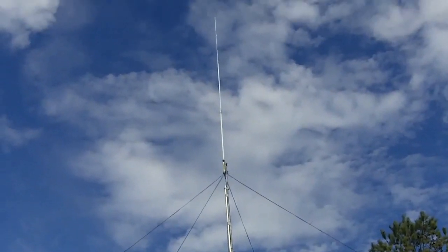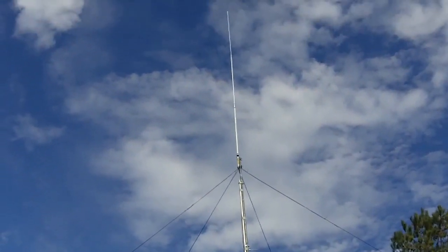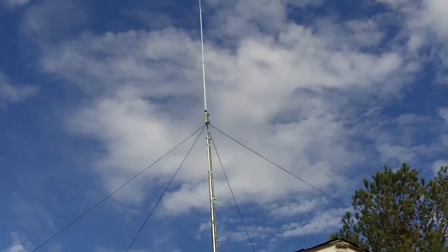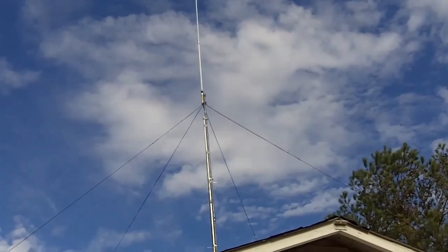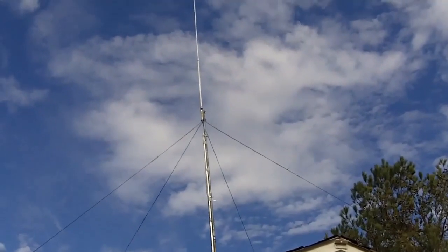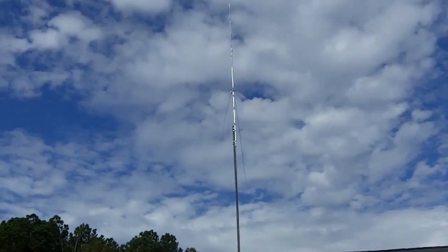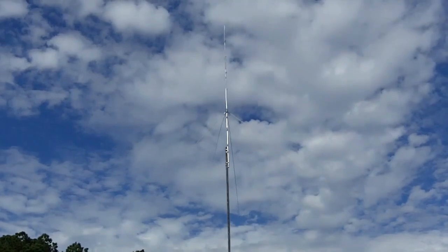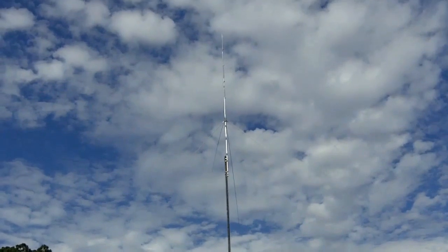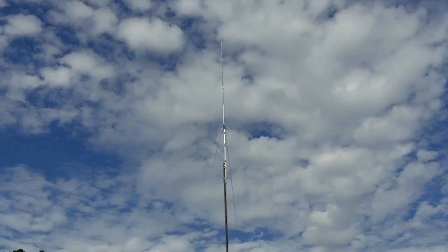In the garage, the unit in Washington is running off of this antenna. That is a 30-year-old Radio Shack half-wave antenna, and I have a homemade ground plane on it. There are four 103-inch long 12-gauge wires attached directly to the base of the antenna. And I'm going to have my Realistic TRC-451 connected to this antenna on my house — this is a homemade quarter-wave ground plane.